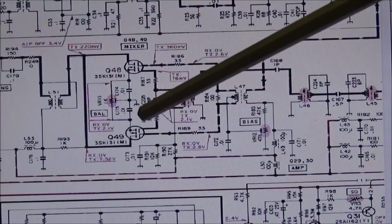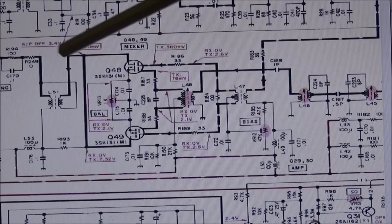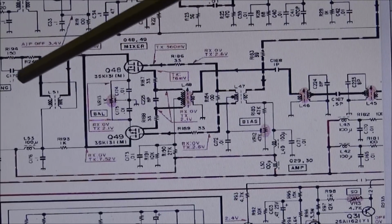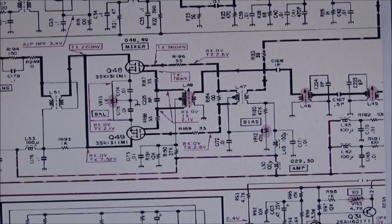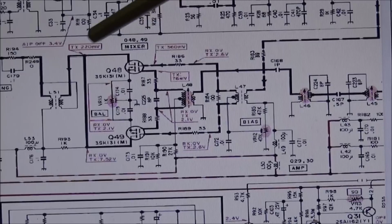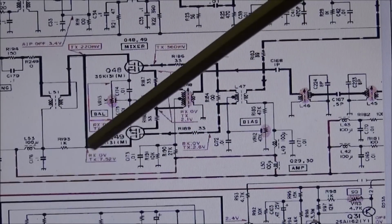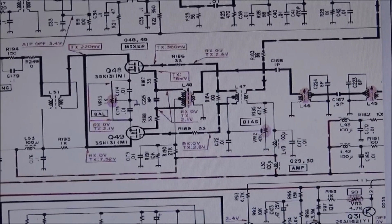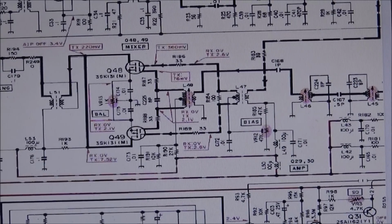So we can check back to here and see if we're getting any signal coming out, and that's what I was going to use the Spectrum for, is just tie right to the antenna port, because that'll read a very low 1/4 watt signal. So we'll have to do this a different way, see what we can come up with. We got a lot of voltages that I can test. Out of the mixer we should have like 2.1 volts on transmit. We'll check through that and see what we find.